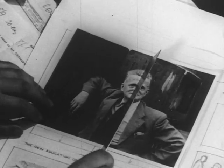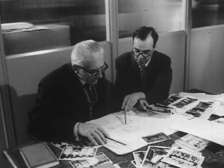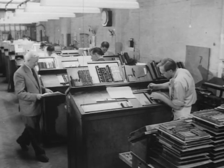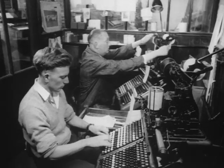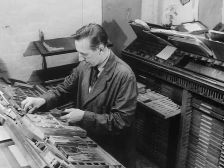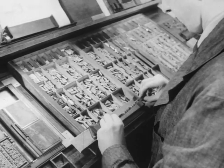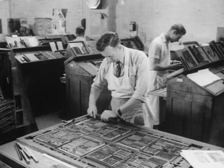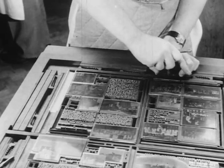A new number is taking shape. Text and illustrations are assembled in consultation with the printer, represented by young John Cheney. The final text and layout are passed to the composing room of Cheney's printing works at Banbury. The type is set and cast on monotype machines. Meanwhile, the headings of larger type are handset by the compositor in his composing stick and transferred carefully to the column in which they belong. These columns of type, and the blocks that will illustrate them, are arranged in page formation on a smooth surface called the stone, and locked together in the form. After the correction of proofs by the editor, the form goes to the press for printing.